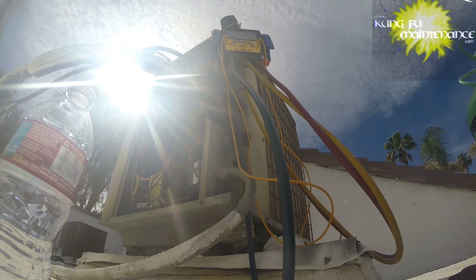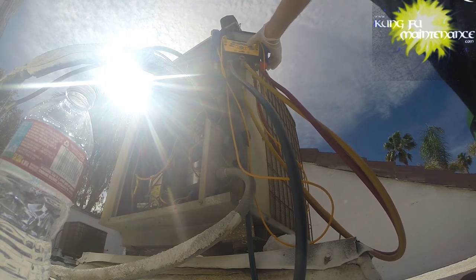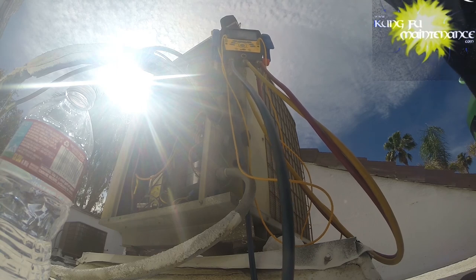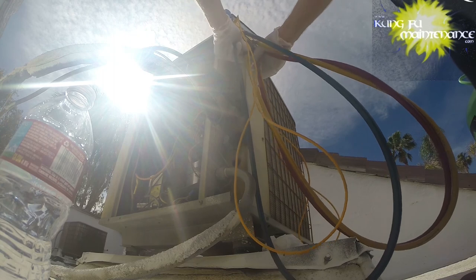And another common spot is the evaporator coil. So I'm just going to be going through and checking those. I need some gas in the system in order to better check that. So here it goes. I'm going to hook up gauges and see what our standing pressure is.